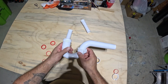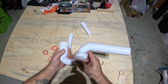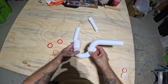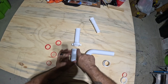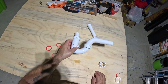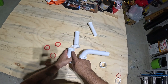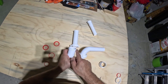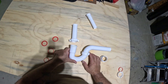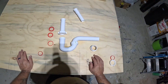These pipes are plastic, so sometimes you might get cross-threading or the thread might be torn or broken — that could be the cause of a leak too. Don't drive yourself crazy if you did everything the right way and you're still getting a little trickle. Return it to the store, get a new one — that's probably going to solve your problem. A lot of times it's not the installation, it's the material. If the threads aren't nice and clean, that's a big problem and causes a lot of the leaks. I hope this information helps — we'll see you on the next one.